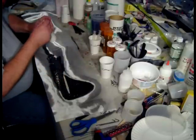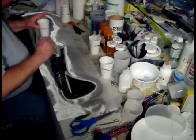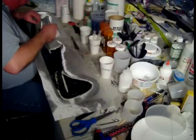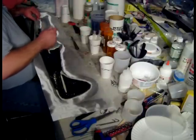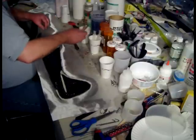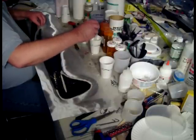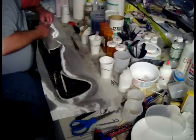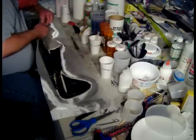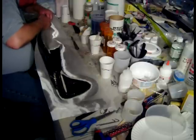It's the 6 ounce cloth that will deform the filler. I missed one spot with the filler while I was putting the filler in — that happens. It's the landing gear blocks. So I'm going to take one of my filler syringes, pull the cloth back, and put my filler around the landing gear pad.